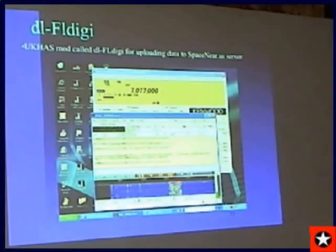The nice thing about Domino is that of all the multi-frequency shift key modes, it is the easiest one to implement in a microcontroller. You don't have to go through all the convoluted schemes and floating point math. There's no floating point math necessary. You just use the lookup table for the Varicode language. You're probably all familiar with this program.